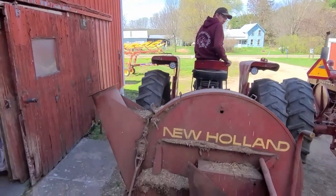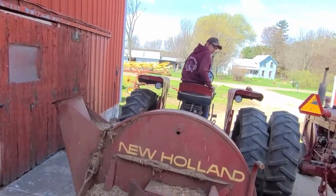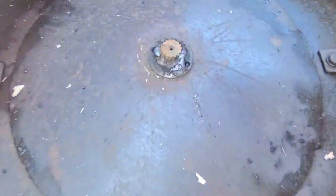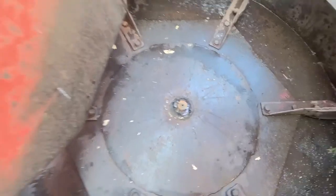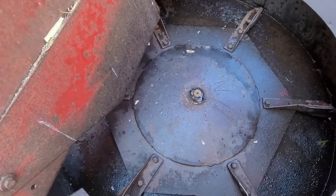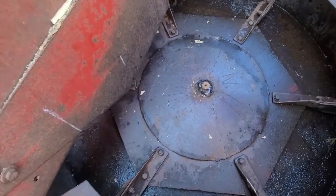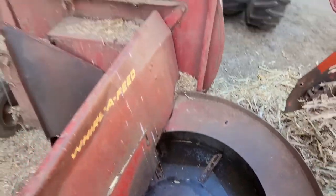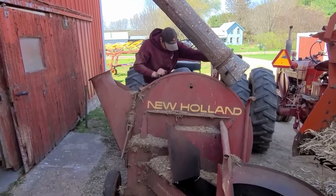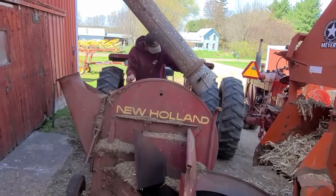Go ahead a little bit. Okay. So we had a mishap. The spinner sheared out and the shaft is sheared out, so I welded it because obviously we're not going to replace it at this moment. And what this blower does anymore as far as work is just bedding, so it's not blowing up a 60-foot silo. I think it'll be fine. So, that's what you do to get by.